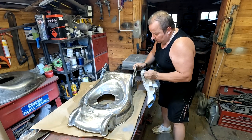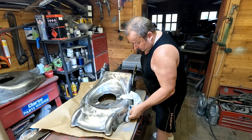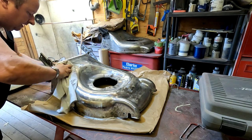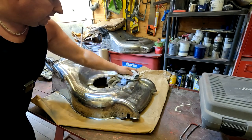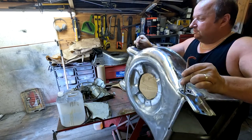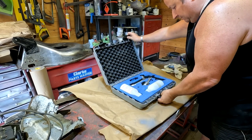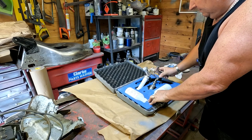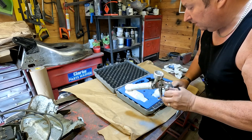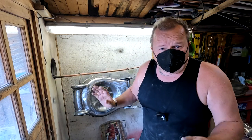As I say, this isn't a perfect spotless part folks — there's still bits of paint stuck on it in places — but if we just make sure it's clean and free from grease, the paint can normally take that. I'll try to hold it as little as possible. Okay, so we'll now hang it up and give it its powder coat. Providing that hangs up like that, we should be okay — yeah, that should go in all right. Those of you who watch my channel would know that I use the Easy Coat powder coating system, and this one doesn't have any mains transformers in it at all. All the magic happens in that little tube there — it positively charges the powder and when it comes out it's attracted to the negative charge on the piece. I'm just going to put my dust mask on and switch my air fan on so it sucks all the crap out, and we'll start powder coating.